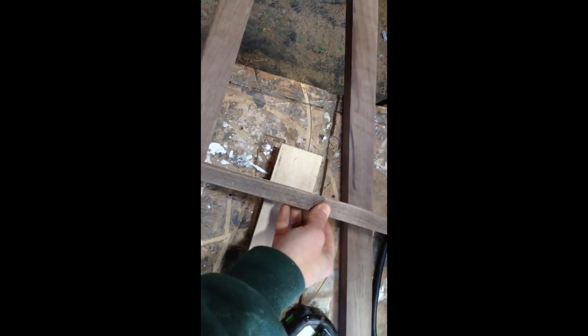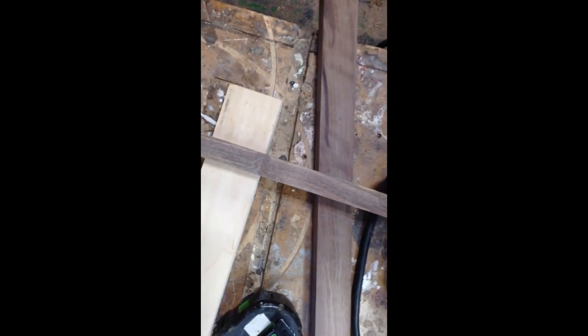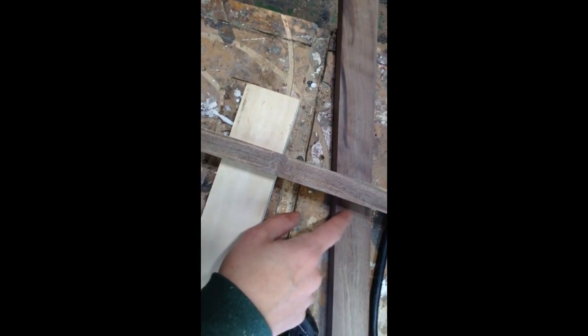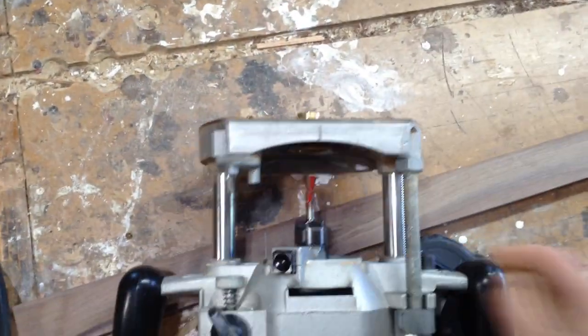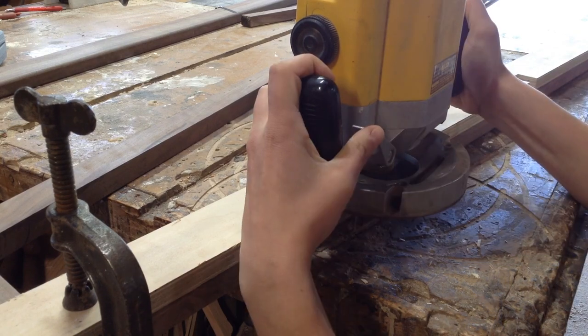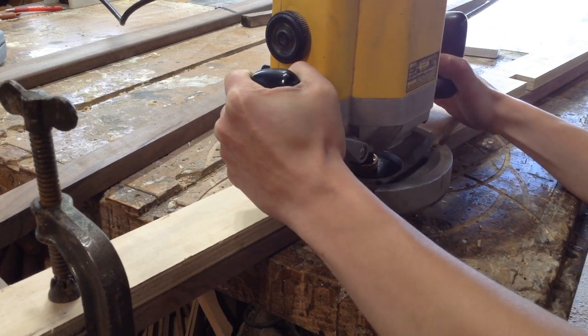For the shelving, I've done this process before — it's a little more involved, but it worked out nicely because this shelving will have a stretcher on top on the back of the shelf and on the bottom on the front of the shelf. I like to put dovetails in there to hold the whole piece together, but you have to make sure the offset is correct. So I made up a little jig. I believe this is a 7/8" bushing and then a 14-degree dovetail bit, and then I could go through and add dovetails in the back using that jig, so they're perfect on both pieces.